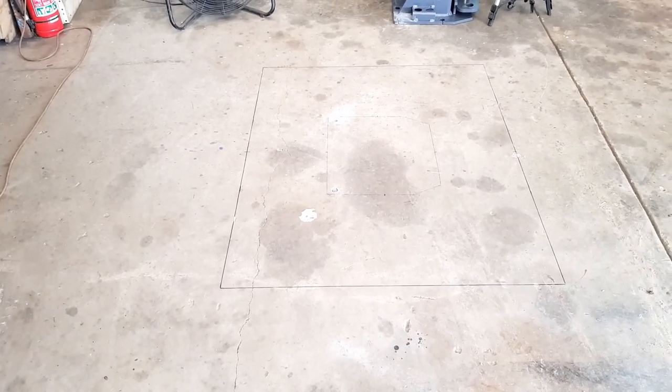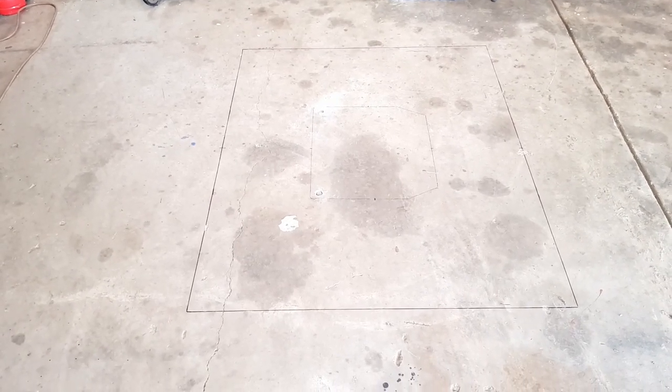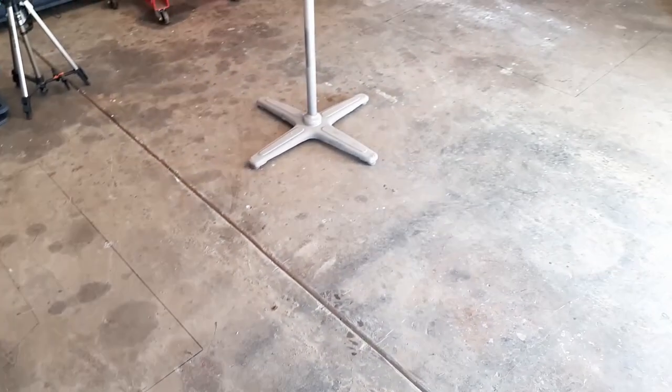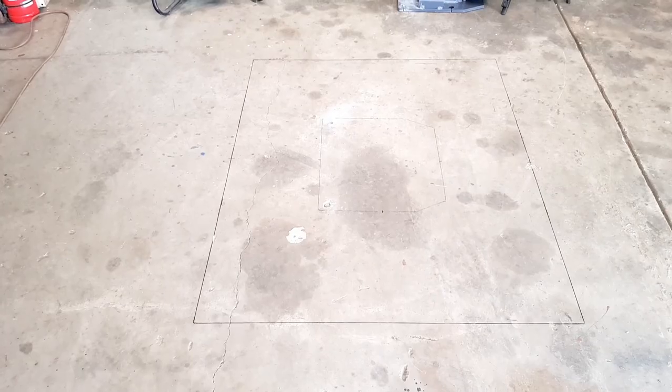We know it's less than 100 mil, so it's not gonna be that pretty under there. But I thought this slab would have been pretty good. It doesn't have any major cracks, there's no movement, there's no height differences. It's just not thick enough. So let's move onwards and upwards and sort it out. So here we go, let's get cutting.